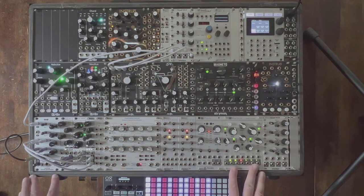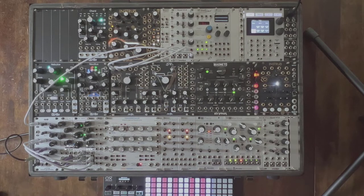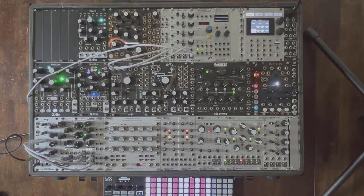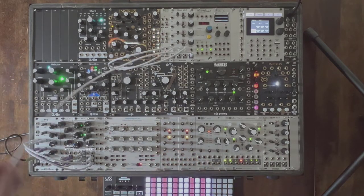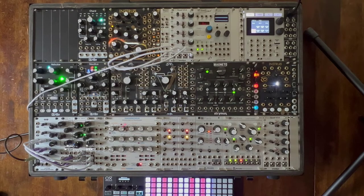Now one thing to notice, if you're new to modular, this always seems to catch people by surprise, is that it's just droning. It's just going on and on and on. So I'm going to unplug that for now because that's really annoying. What we want to do is control the envelope. In other words, we want to control the sound moving up or fading away, so it's not just constantly onslaughting. So to do that, we're going to send an envelope to the VCA, and that envelope is going to basically turn those knobs up versus bring the volume back down.